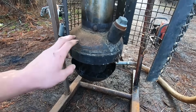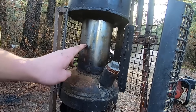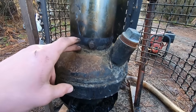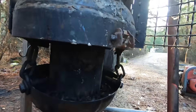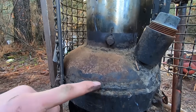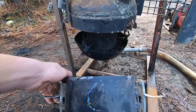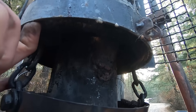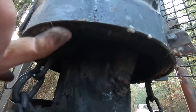As for construction, it's mostly made of freon cans. I've got this one here with a piece of sheet metal reducing it down to size with a taper. This tube goes all the way down and is just a collar over it made from the removed top of a freon can, with a hole the same size as the external diameter of the tube. Another can lid is turned over and welded to make a patty shape underneath, and I welded on a flat bar to support the sides of the container. The taper guides it into the channel where I inserted fiberglass wood stove gasket to give it a nice airtight seal.